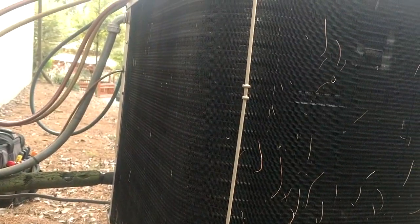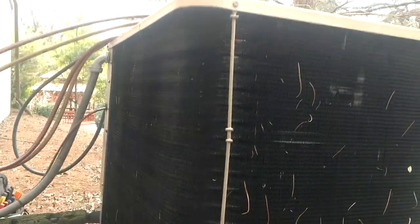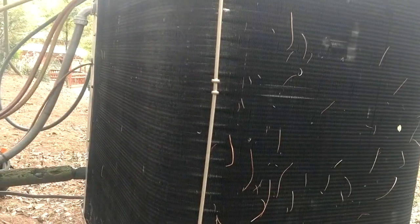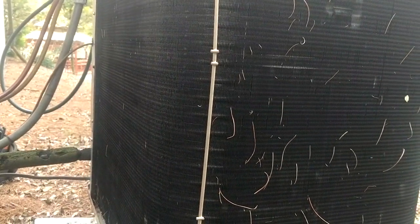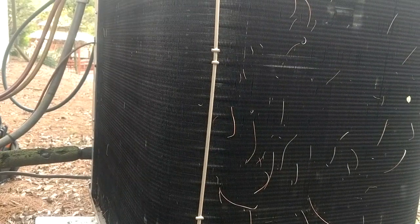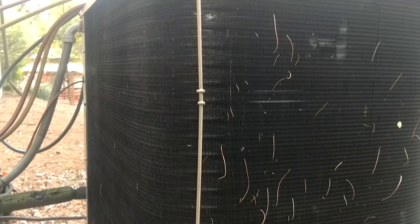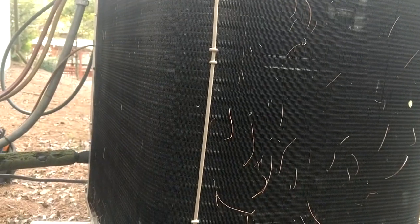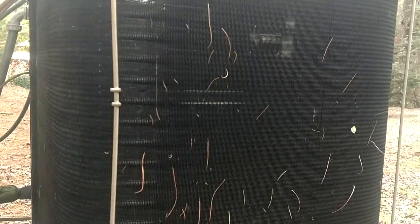This is just going to be a super quick little tech tip here. We're working on a good old Air Ease unit — one of the worst units ever made. The vibratinest damn units I've ever seen. I don't know how many of them vibrated right through copper, through the TXVs. Bulbs lost the charge in the bulb. Feeder tubes vibrate. You name it, these things are just terrible. TXV problems.